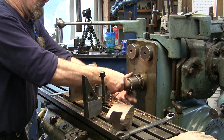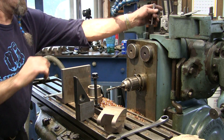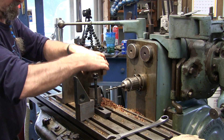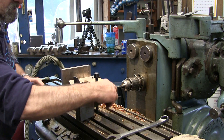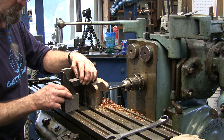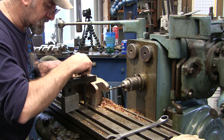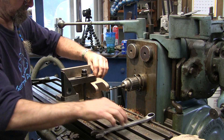Okay, we got the right drill. All right, put our cap back on, we do the same thing — set it square again. I found that some of these bores are a little bit looser than others because we were requested to make two different size bores, so we did have some of them with a little difference on the width and things like that. But they're parallel within a couple thousandths, which we proved.